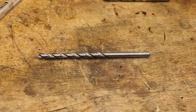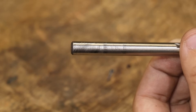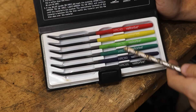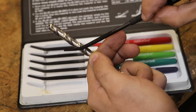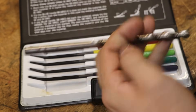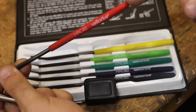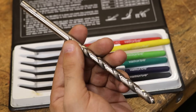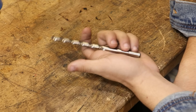The best example I can point to is this drill bit — an Australian-made Sutton's drill made from M2 high-speed steel, which is a pretty good piece of kit. Using my hardness testing files, which go from Rockwell C40 to 65, at the cutting end of the drill bit not even the Rockwell C65 file can bite in — it just slides off, showing the flutes are at least 65 Rockwell C. However, at the chucking end it's been left soft, less than 40 Rockwell C. It's the same piece of high-quality high-speed steel, but two very different hardnesses at each end — all down to heat treatment, nothing to do with the quality of the steel.